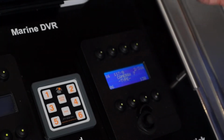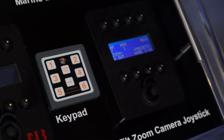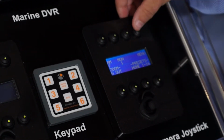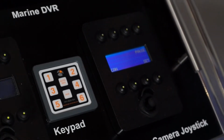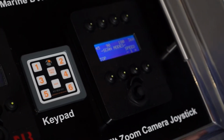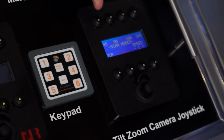So for the purpose of this session, we're going to be controlling a 116. I'll tell the camera that camera 7, address 7, is an Iris 116. Go back to the menu button again, and now because it knows the features of a 116, I can, for example, set a scan mode, because the 116 has a scan facility.